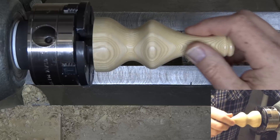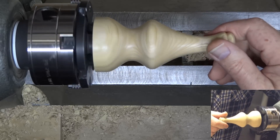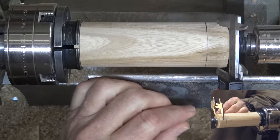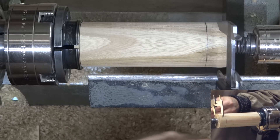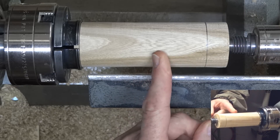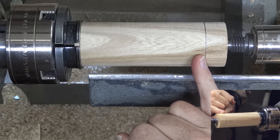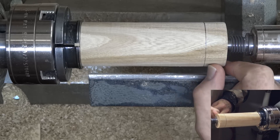This works very well for putting the finish on; however, I need these pin jaws so I can turn the other two lids, so I'm going to have to make a jam chuck for this now. I've set my calipers one-sixteenth of an inch larger than that inch and three quarter Forstner bit. When I'm turning this tenon down, I'll be able to put this on here, and as soon as it's clearing it well, I'll know that I'm very close, and then I will very slowly sneak up on the sides until this lid will fit over there snugly. I'm going to shorten this piece and put a tenon into here — I don't want this to be so far out that there's vibration. This line indicates the depth of the cavity under the lid, and I don't want to go all the way there — I do not want this bottoming out in that cavity.